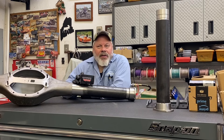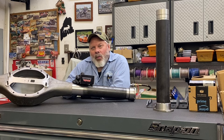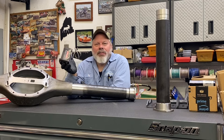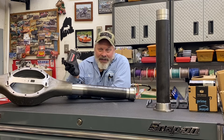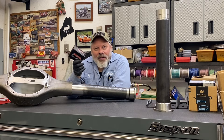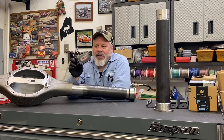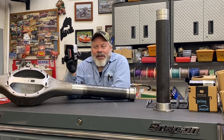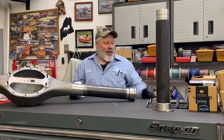The early big Ford brakes that I have — drum brakes — like I said, they've been sitting around more than they've been used. One wheel cylinder was carefully capped off and it's perfectly usable; I'm sure the brake fluid in it is fine. The other end didn't have a cap and it's kind of rusty looking, so for the money I went ahead and bought wheel cylinders. There's a number cast into the factory ones that I was able to cross-reference, and these appear to be correct. They're Dorman. You flip the box over, they're made in China — so it is what it is. Twelve dollars. Hopefully they're usable.